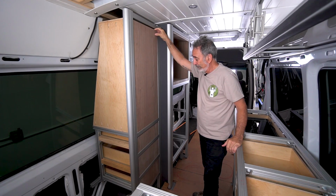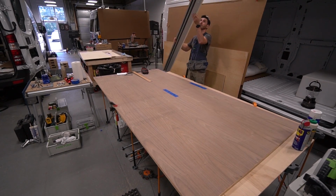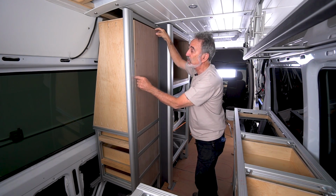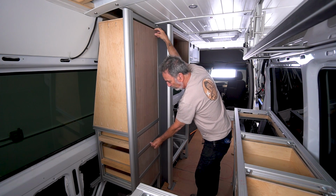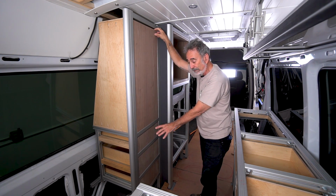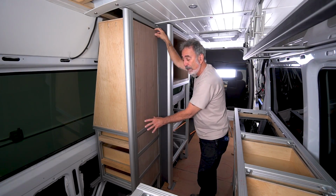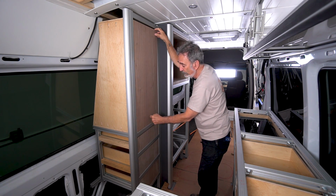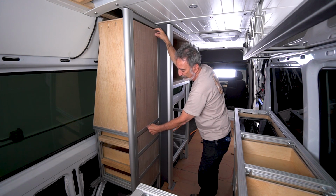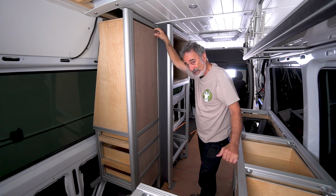And what I mean by that, Alex started with a full sheet of walnut plywood, and he calculated the saw kerf, the spacing, the thickness of the edge banding, 2 millimeters, and then he also figured in these aluminum strips. So he laid all that out on the sheet. He removed this portion from the sheet, grain matched all the way through. You would want to remove this so the grain stops here, removed, starts up again. That's the kind of detail he's bringing to this project.